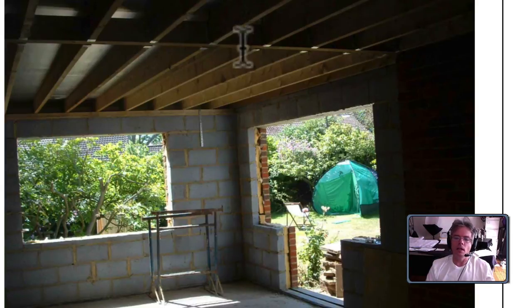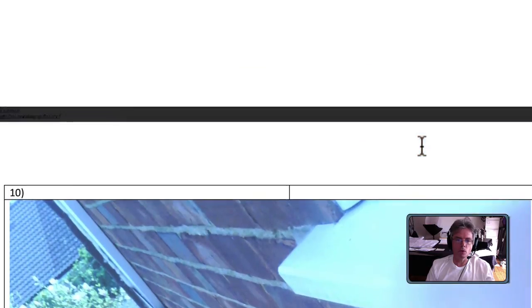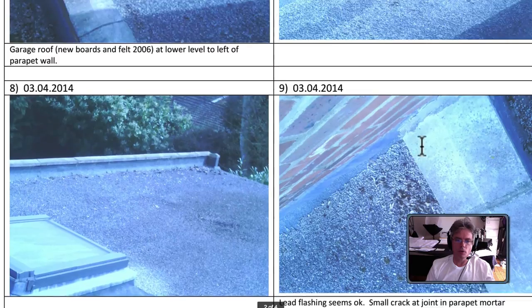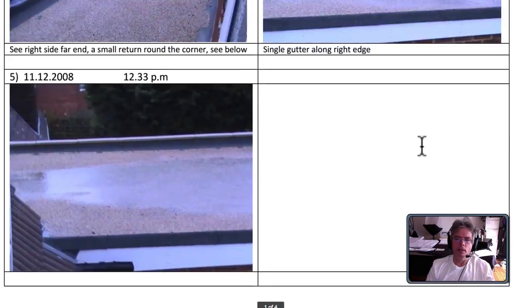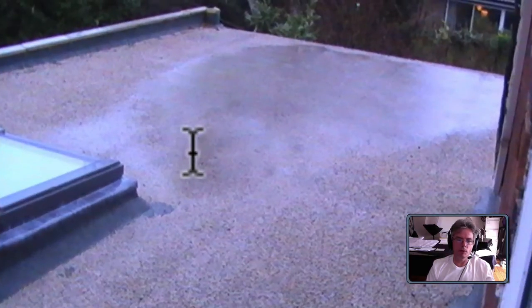I can't see if it's a double timber, a single timber, a steel, or even what we call a flitch beam — not to get too technical. Is it crucial that you get rid of the water? Well, the water is going to make things worse, and it's not helping the fact that you've got some kind of movement of the roof, which we call deflection. How far it goes really depends on whether the room inside is completely open or if you've put any separating walls up.